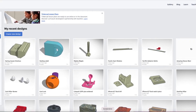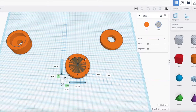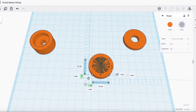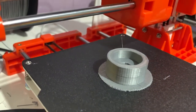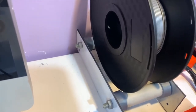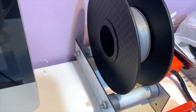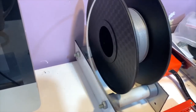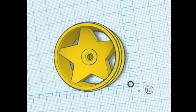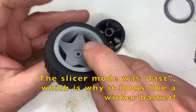Now back to the fantastic Tinkercad. I've used it to alter or create a few parts with about 0.2mm accuracy. The first adapts a skateboard bearing to 25mm height — four of these become my filament roller. I have a 1kg roll of PLA filament, and for large objects you need the filament to spool without tangling. I used 10cm pieces of 25mm plumbing pipe, two pieces of aluminium composite, four bearing adapters, four skateboard bearings, four 3D printed washers, and two M8 bolts. Next I designed a radio controlled car wheel — it's only a rough prototype but it does fit the tyre, showing you can make working parts.